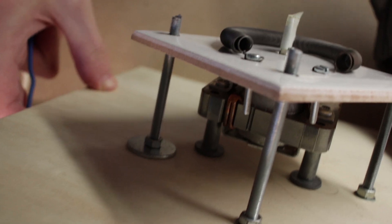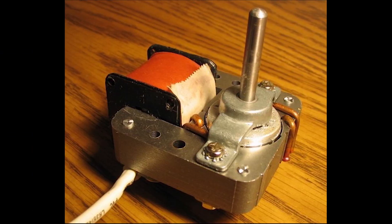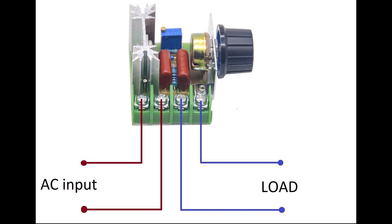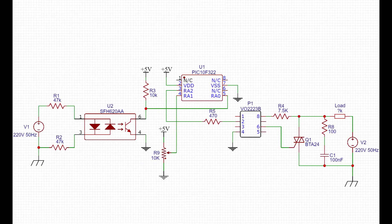Now let's talk about the electrical part. You need at least one of these dimmers for temperature control — it has 220V AC as input, this one is from Aliexpress. The motor speed control is different; it depends on the type of motor and the circuit you need. Using a dimmer for a shaded pole motor is not a perfect solution, but because a better circuit for this motor is more complex and expensive, I use a dimmer anyway. We do not really need very accurate speed control — it's required only for a smooth start, avoiding the break of the cupcake cap. Because it's too easy to just buy the dimmers, I made two DIY circuits: one for the heating and one for the motor.